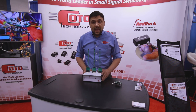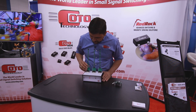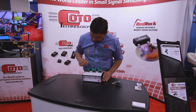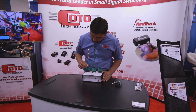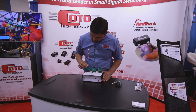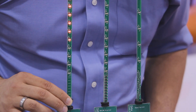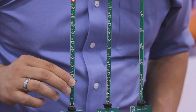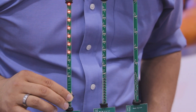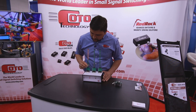Or, utilizing the analog sensor I demonstrated earlier, we can actually eliminate the ladder entirely and just have a single sensor at the bottom of the reservoir, detecting as the magnet is going up and down. We've completely eliminated the need for the ladder itself — we only need a float magnet and a single sensor that, given that the enclosure is probably magnetically permeable, can be on the outside.